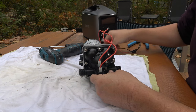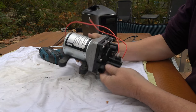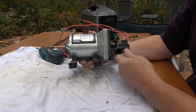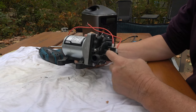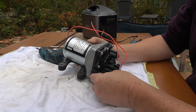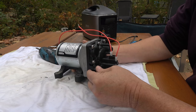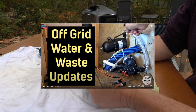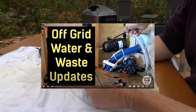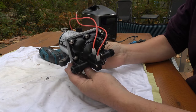Anyway, like I said, I've replaced this pump and I just keep it now as a second backup pump. I replaced it with a newer pump because this thing was starting to cycle quite a bit — I think the switch was starting to go. I got a brand new pump because we dry camp an awful lot, so this thing has seen a lot of use. I also installed an accumulator tank to make the flow a lot more even. If you want to see those videos, I'll link to them in the description. Until next time, Ray from LoveYourRV.com — cheers everyone.